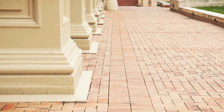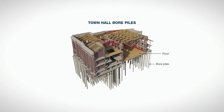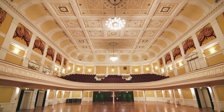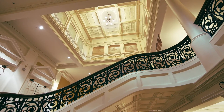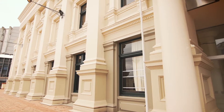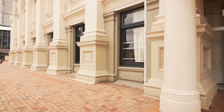In 2007, council deemed the town hall to be earthquake prone. This is because it is built on uncompacted reclamation. It's also got very shallow piles and it's also an unreinforced brick masonry building. Council wanted to base isolate the building, and the reasons for doing this were that it gives the greatest level of protection for people in the building, and also the greatest level of protection for the heritage of the building, meaning that most of the work would be done below ground and retain much of the heritage above the isolation plane.